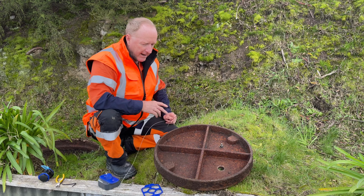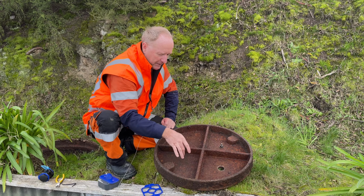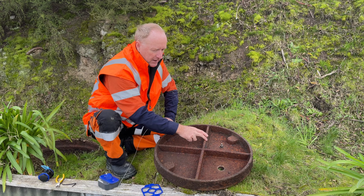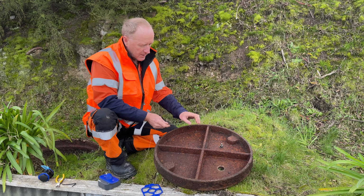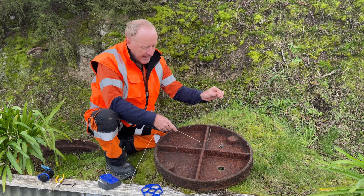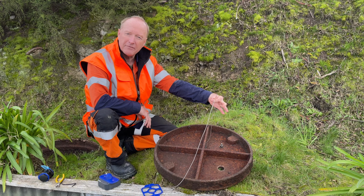And we need a fourth hole, which sits just in the rib, just up in here. It can be in any of those pizza slices or rib. It doesn't have to be here. Closer to the unit is fine, but not important. So the hole here would literally take the stainless steel cable for the beacon, where the beacon will get attached to the lid itself.